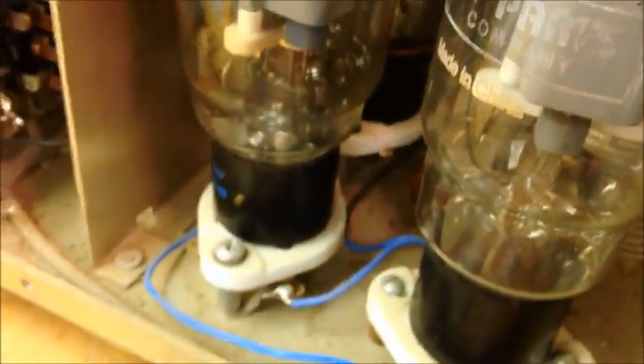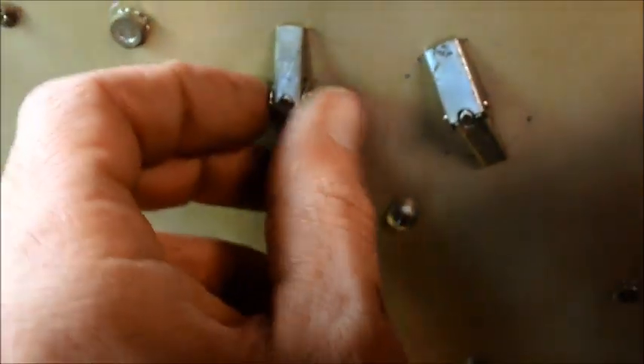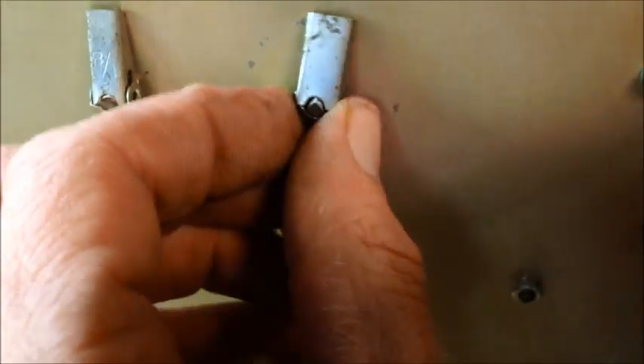But this was the thing that really got me. See, somebody added the 4th tube in there and basically they went off of one of the tubes and jumped things over. What do you think about that mounting hardware there? A couple of old wall anchors, man. He used wall anchors to mount the 4th tube socket down, and look — it's loose, they're loose man, it's not even tight. So I'm going to pull this out and mount this socket correctly; it's all wobbly up in there. But this is the kind of stuff that you find with homebrew.